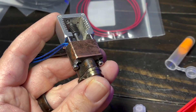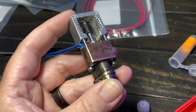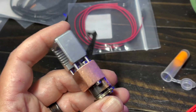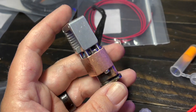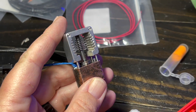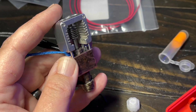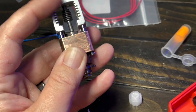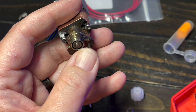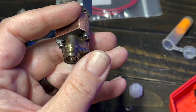That's the total rebuild of the Slice Magnum Plus — a hot end that I believe is yet to be sold. It's a very unique, high-flow hotend — longer than a standard Mosquito but still very compact, with the same mounting style, fan, heat break, and standoffs. The only differences are the block, the hardware that pulls the block and heat sink together, and the unique nozzle cover design that keeps airflow away from the nozzle to retain heat better.